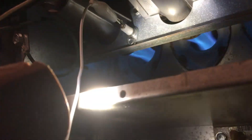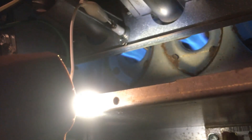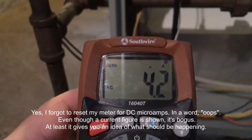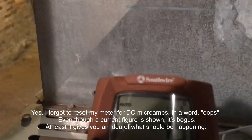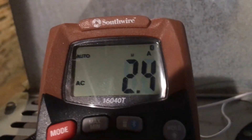Here's our ignition. It's probably not bright enough on camera. You can see where the flame rod goes into the path of the fire going into that burner assembly into the heat exchanger. When it's operating, it generates a minute electrical current, which is what you're seeing right now. I'll go ahead and remove that jumper wire, and when I do, the burner flame will go out and you'll see that small amount of current being generated by the flame rod disappear. There it went.